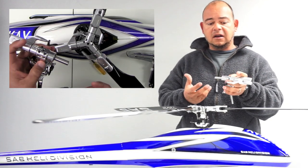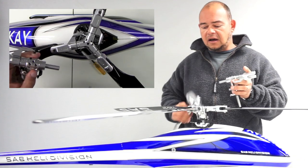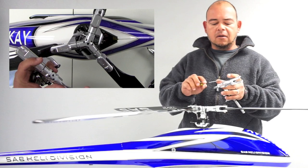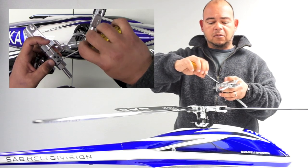So if you need to remove the screw, I recommend you use some kind of heating device — for example a torch or a heat gun — and just heat it up really well. Get it really nice and hot, and that will help break down the Loctite. Then when it's time to loosen the screw, it'll be much easier and you won't run any risk of potentially breaking the head of the screw.